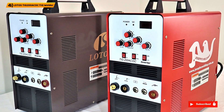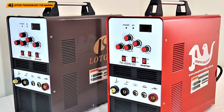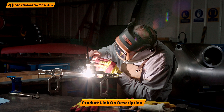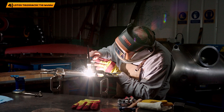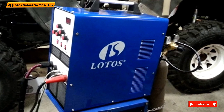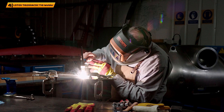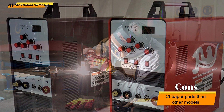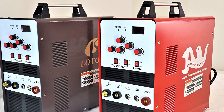Input power: This AC-DC TIG welder has a 120V and 240V power input depending on the task at hand, so you can work on heavy and light operations with high efficiency. It handles both thicker and thinner metals, making it one of the best TIG welders for all-around use. Duty cycle: The machine has no issues with continuous welding, offering a 60% duty cycle with 2-4 minutes rest within 10 minutes — ideal for most tasks. Weight and size: This TIG welding machine weighs 58 pounds and measures 28 by 13 by 17 inches, with a durable, easy-to-carry handle for portability.